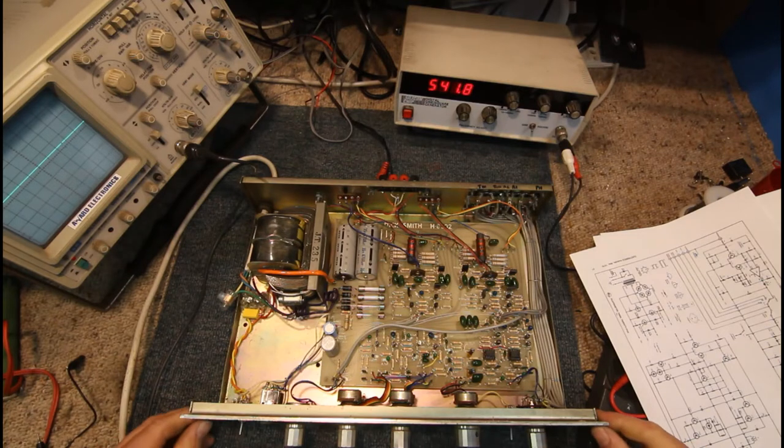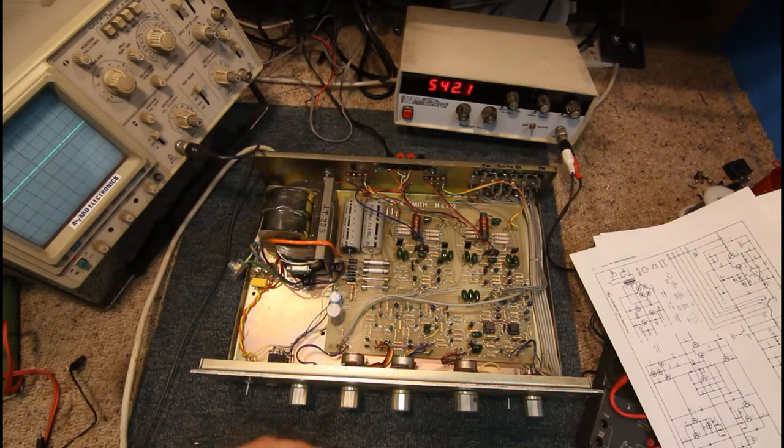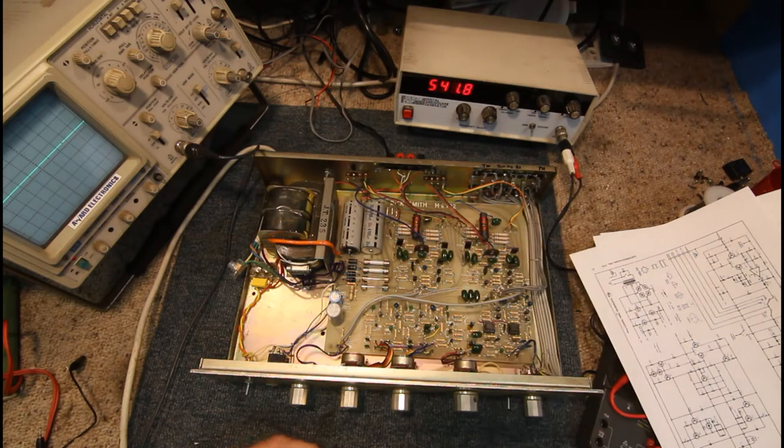It was a bit more of an advanced design in its day. This was a bit more advanced than some of the earlier amplifiers — less feedback. It also has a couple of pots to set the quiescent current, so the transistors are always set to just be on even if there's no signal, so they're ready to handle any sudden transient signals that come in without distorting.